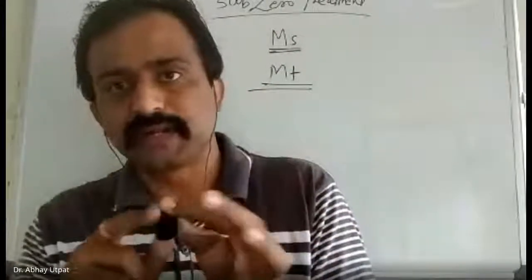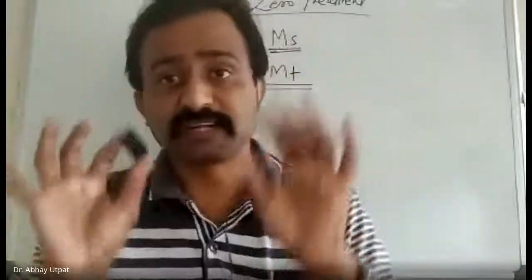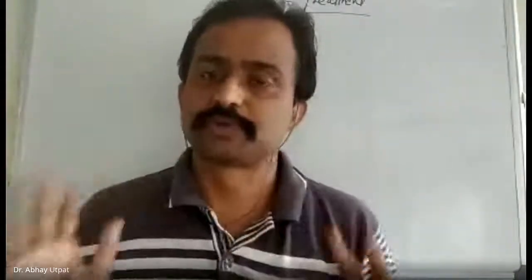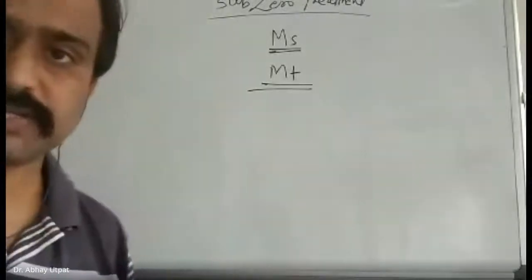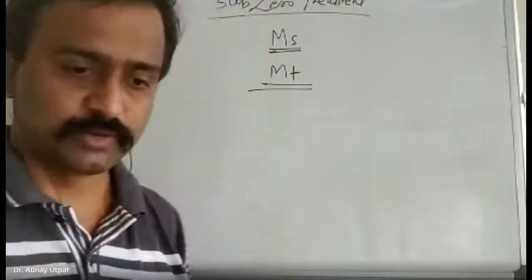So 100% martensite, and now do the tempering. Tempering will not change its dimensions. Are you getting? Tempering will relieve the stresses. And that's why such components, measuring instruments, which are finally machined and then hardened, are sub-zero treated. Remember this. Even if you didn't understand, you can ask me later, because this is a very important concept, sub-zero treatment. I hope you understand. Is there any doubt? You can ask me now only, so that I can go to the next. You can ask orally, don't put it in the chat box.